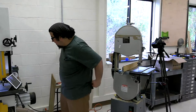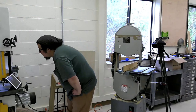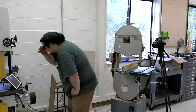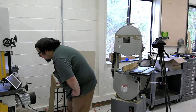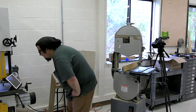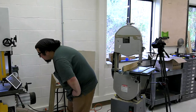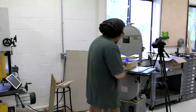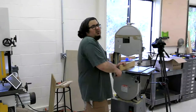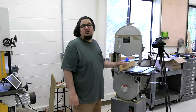So let's see, what do we have going on here? Turn on bandsaw, rubbing a piece of steel on one side. Oh, okay, David's talking about stoning the blade, yeah. If you've got a carbide blade that is jumping around, turn on, yeah. I know Raleigh Johnson's book has a whole section on stoning a blade probably, and we should try and get that online sometime, Katie.